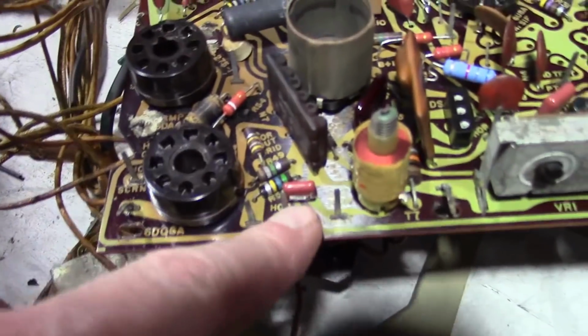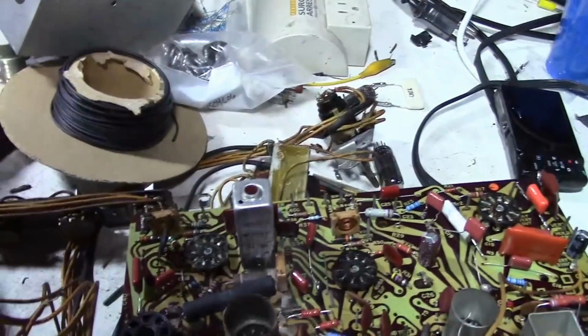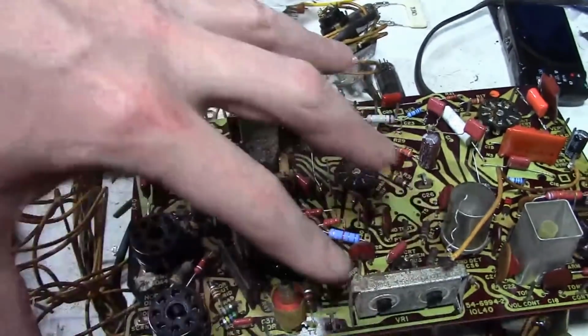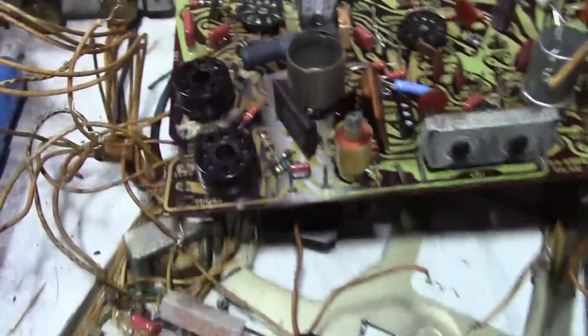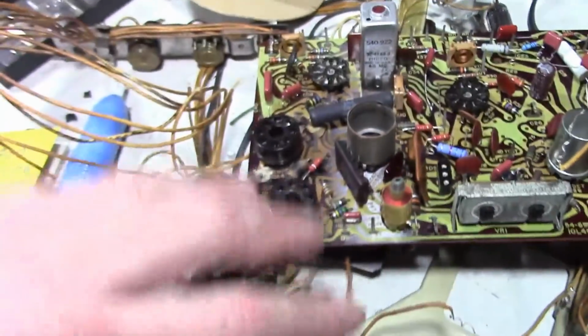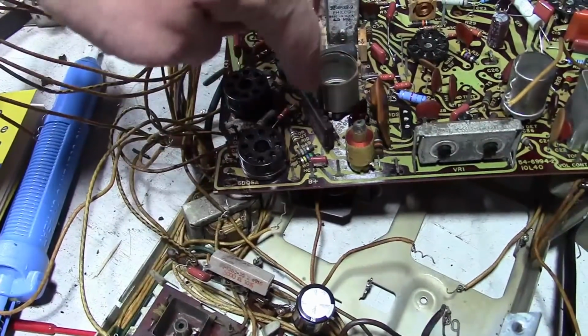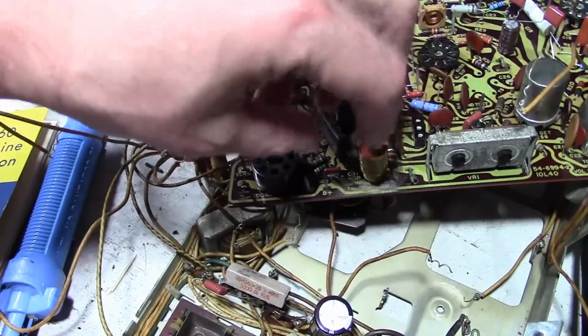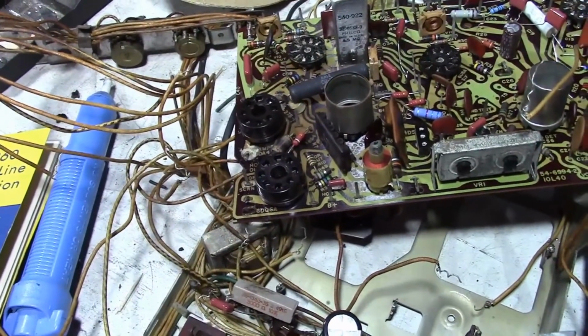Put this down for a moment. Originally the cap would have attached here, and it ran around the board, and the filter cap sat over here. So anything even remotely over in here is a lot better than the situation was before. My point being that the capacitor is there to provide bypass for this circuitry. So putting the capacitor near it will help the circuit to function better.